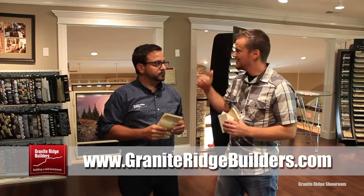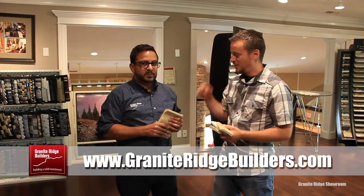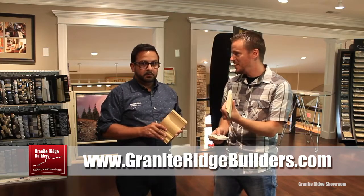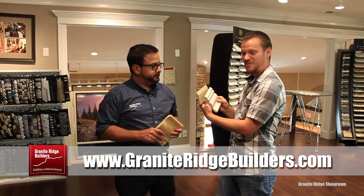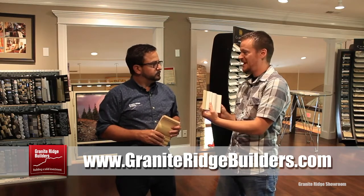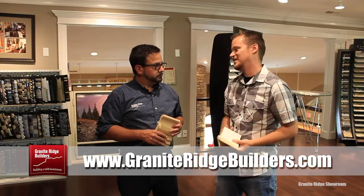So Izzy, behind us, right up where that corner is of that ceiling and that wall, that may look like one giant piece of crown like you have in your hand, but actually that is 3 pieces that we've taken. It could be 2 pieces of base that we attach to the ceiling and the wall, and then bridge that with a piece of crown. So we actually call that a built-up crown, and depending on how much you pull that piece of base in and out, it can really give it a sharp look and make it look like a real thick piece of crown up there.